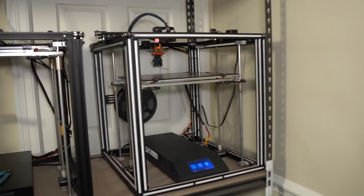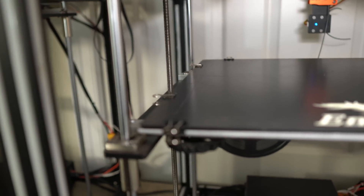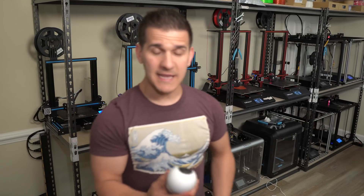This printer operates the same as the Pro V2 — it has a nice touchscreen feature. I'm going to run a leveling sequence. It's been squeaking on me lately, but pick your battles. Now all the printers are up and running. Having this many printers running is going to come with some worries or fears. You can use something like Octoprint and integrate all of these printers into it and get an app for your phone, but what I personally like using is a Wi-Fi camera and a Wi-Fi socket. With this combination, I can watch my prints from anywhere. If I see one of them start failing, I can hop into the app and turn that printer off or cycle the power. You never want to turn the printer just off and leave it hot because it's not going to cool down properly — you'll turn it off and then turn it right back on using the Wi-Fi socket. This is a Reolink Wi-Fi camera that actually swivels left, right, up and down, so I can put it somewhere in the room and watch multiple printers at the same time.